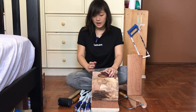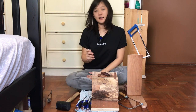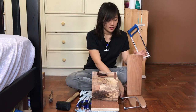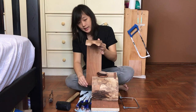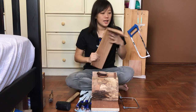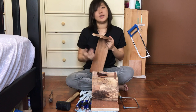Before I show you the bangles close up, what we're going to need are a mallet, your chisels of different sizes, a marker, something to mark out the circumference of your bangle, and a coping saw. This over here is called a bird's mouth jig and it helps me elevate the point at which I'm going to do sawing with the coping saw. I'll show you how to work around that if you don't want to build one — it's just pieces of wood joined in an L-shape with a small opening that allows you to move the coping saw around.